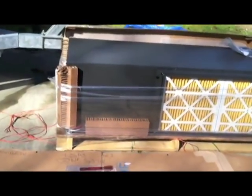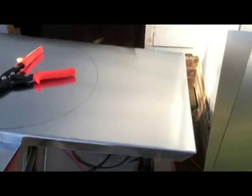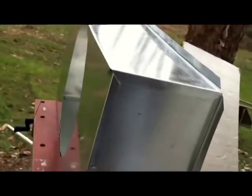Here's where the ClimateMaster unit was delivered on a pallet. I was able to put it on a hand truck to bring it into the crawl space. I mounted the unit on a threaded rod attached to a super strut that I bought from Lowe's for about $30. I also built a return box to adapt from a 16-inch flex duct to the side of the unit, but you can buy this from Ingrams or have it made locally at a metal shop. I insulated it with foam board.